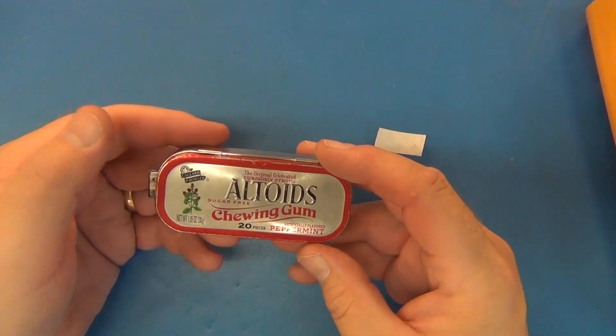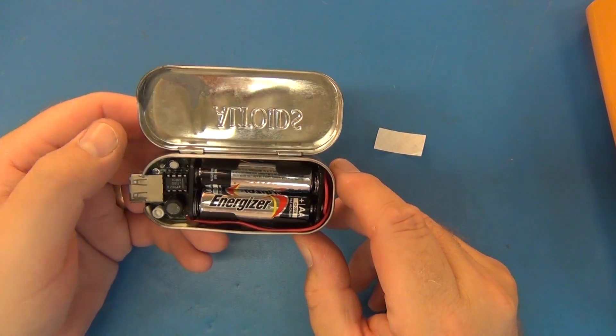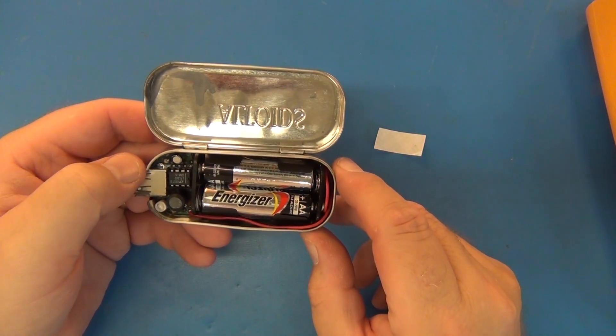I cleaned it up again and it works, but that's the tip. It's a quick and easy way — leave your batteries in your MintyBoost when you travel and not worry about the quiescent current taking off all the juice for this chip.